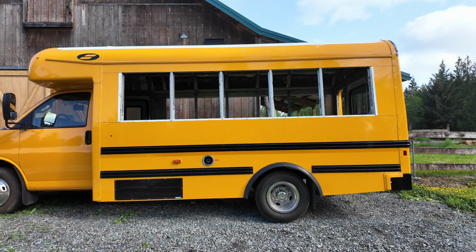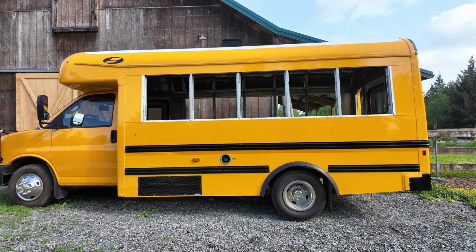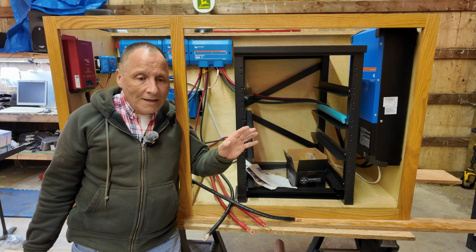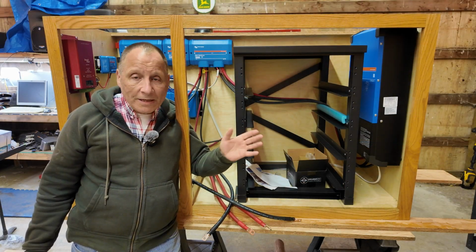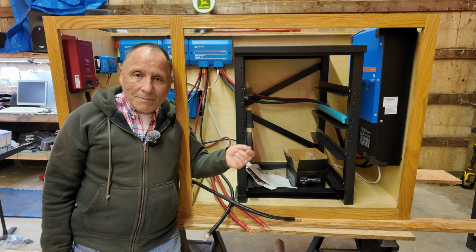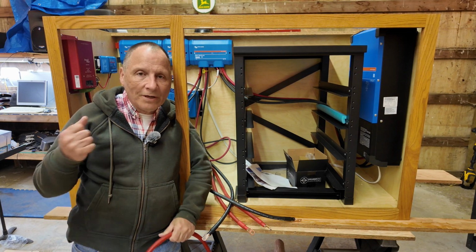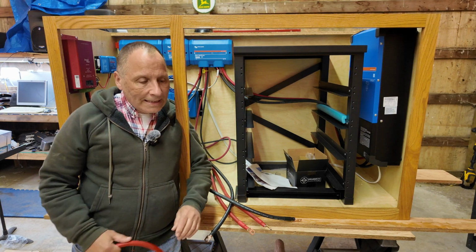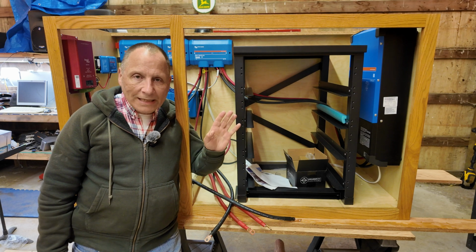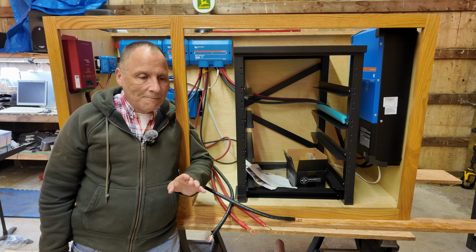It's going to take a bunch of folks because that sheet of aluminum is 12 feet long. It's not that heavy. It's 50 pounds for each sheet, which if you've got 4 people on it, that's not too bad. We'll need somebody inside the bus drilling pilot holes so that we can pop in rivets real quickly and get enough rivets up there that people can let go of the sheets. But I'd love to see a whole bunch of folks out here.